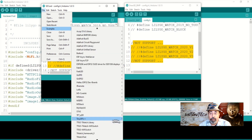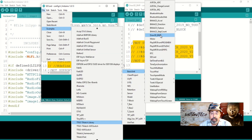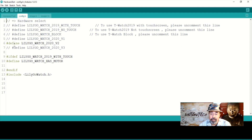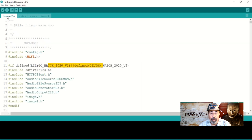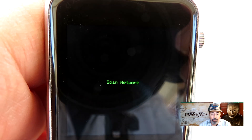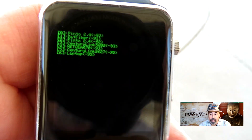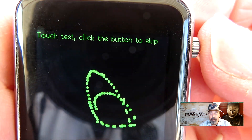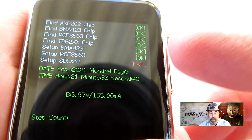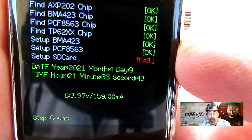It is interesting that the original example sketches for SD cards say they do not support the T-Watch 2020 V2. I found this hardware test example sketch has the TF card functionality and does support the 2020 version 2 watch. So let's load this one. This is not what I like to talk about, but I found that the SD card does not work with the back of the case closed. It does work when the back of the case is removed and the battery is not fully pressed into place. I have two of these watches and they both behave the same way. It seems there is just not quite enough room for the battery and the SD card. So I wanted to caution you on this point. If you have some ideas about how to work around this, leave a comment down below.